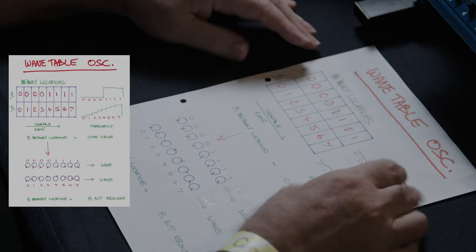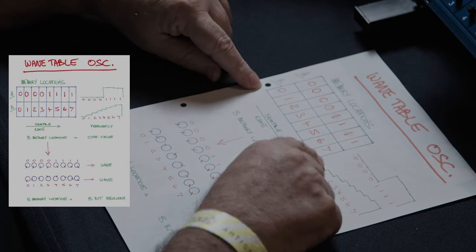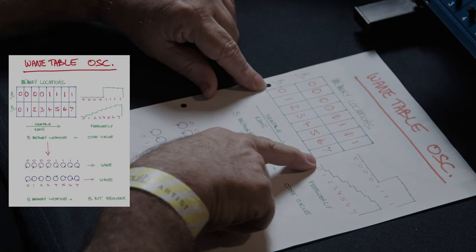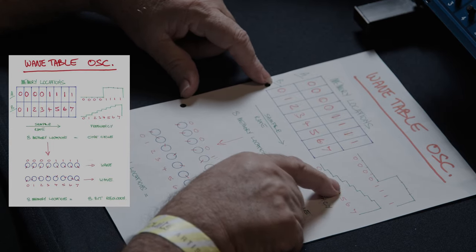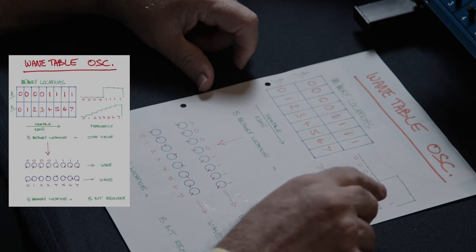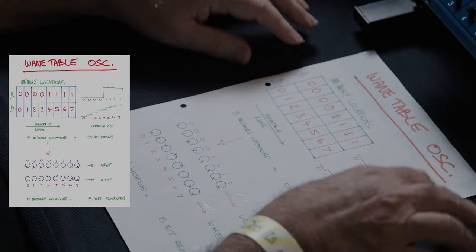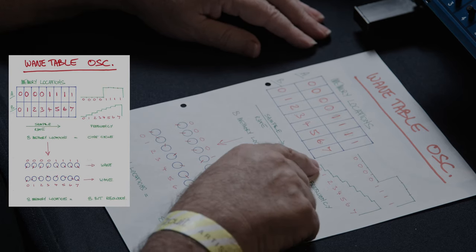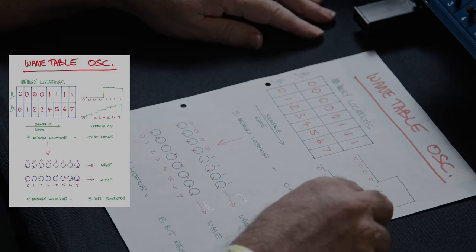If, on the other hand, we go to another place in the same library, we have the values from 0 to 7 incrementing all the way through 8 steps. When the DAC outputs it, we get a stepped waveform which resembles a ramp. It is not a straight line, but because this is digital, unless we apply anti-aliasing and other processing, it would remain a stepped one. However, as you can see, it is a very good facsimile of a ramp.